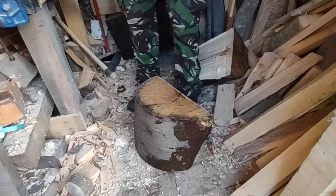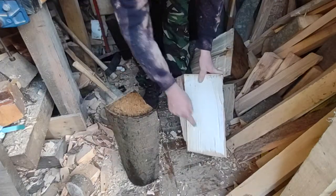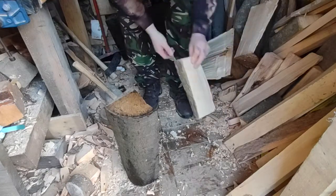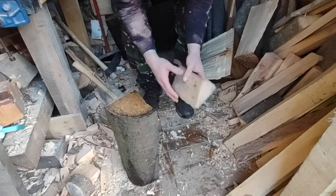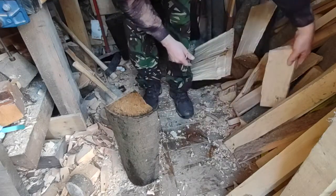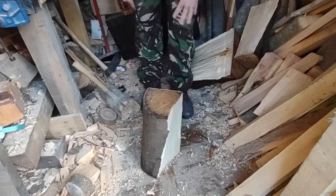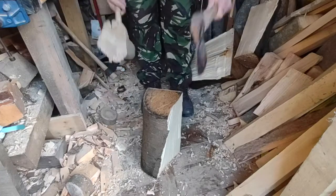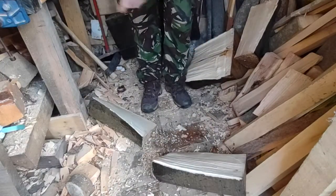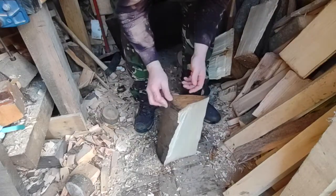Down to quarters now. See how the grain's quite nice and straight — that's what I'm going for. I like to carve my spoons from radial clefts. Here's a piece of ash I cleft out for a spoon and then didn't like, so I let it dry out — this is what a radial cleft looks like. I'll turn now into an eighth. A bit easier now because there's less material to split apart. We've got ourselves an eighth — no inclusions, it has twisted a little bit but not a massive problem.